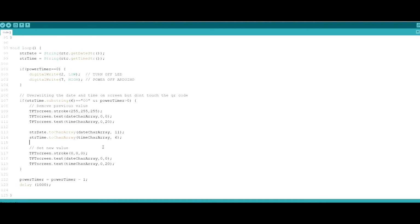The way the screen actually works, because this was a little bit confusing to me at first, you don't need to draw anything at every loop. Basically, if you draw something just once, it will keep it on the screen all the time until you, let's say, reset the background color or write something on top of it. So that's what we are doing right here.